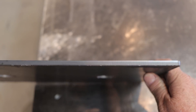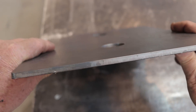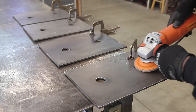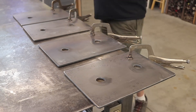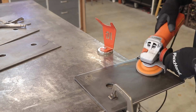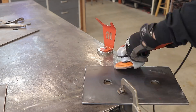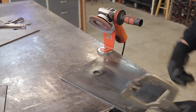Here's a close-up of the cut — you can see how nice and clean it is, not just on the outside but even the holes on the inside. Super clean, super true. Just a very little amount of dross on the outside, but we're going to trim that up with the Walter mini angle grinder. This grinder has a paddle switch and I absolutely love it. Combined with the Enduroflex flapper discs, it wastes no time cleaning these edges up. There's a good shot of my angle grinder holder — the thing works really well.